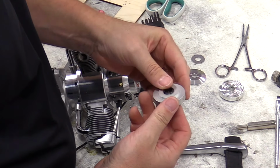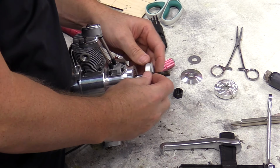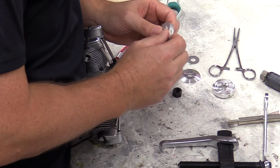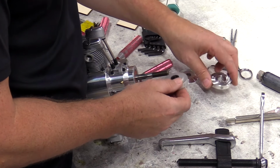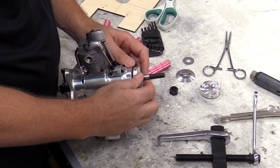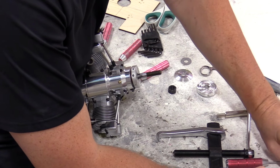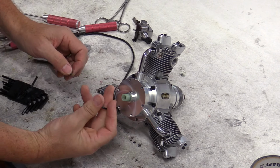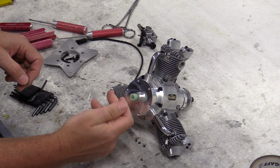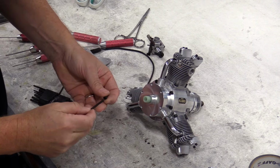And the other thing is I used a different magnet ring. I've got the magnet ring from CH Ignitions. These were both modifications that came from some friends who have run these engines a whole bunch. They say they're the two things that really make those engines run even happier than they already do out of the box. It helps with the intake especially, because the #1 cylinder tends to run a little hot normally, and so that new intake helps to distribute that a little bit better, so that the #1 cylinder doesn't run quite as hot.